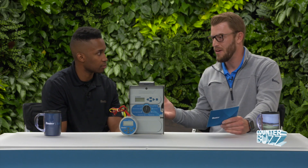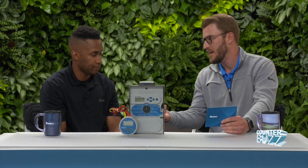One question that always comes up is: I've got to install this valve — am I going to have to come back later if I'm temporarily using a solar or battery-powered clock and change the valves out, because it's one valve for DC and one for AC? Our engineering teams are forward thinking — they always have the best solutions for the industry. You take the DC solenoid off that valve and replace it with the AC solenoid in the valve bonnet, and everything works the same hooked up to an AC controller. All you're doing is removing the DC solenoid, putting in the AC solenoid, switching out your controller, and you're irrigating the same day.